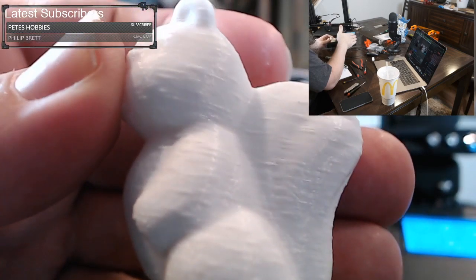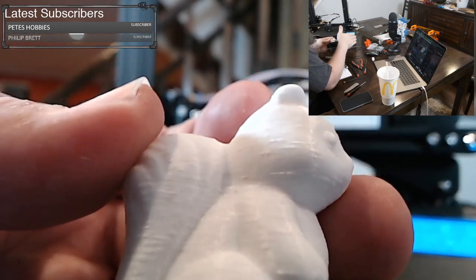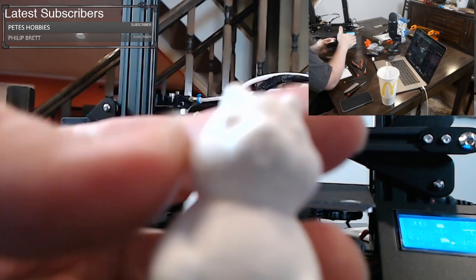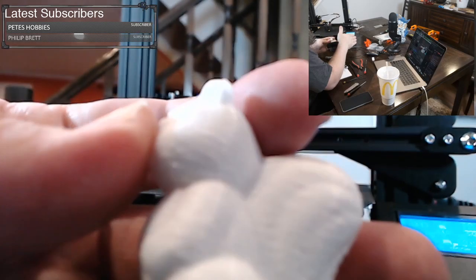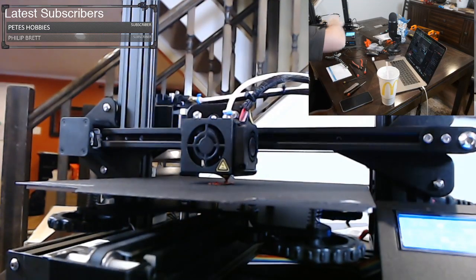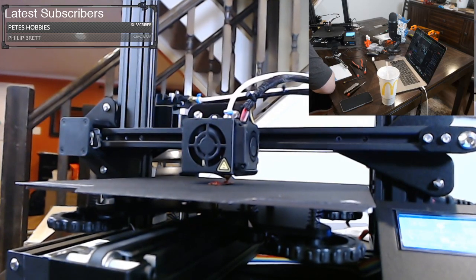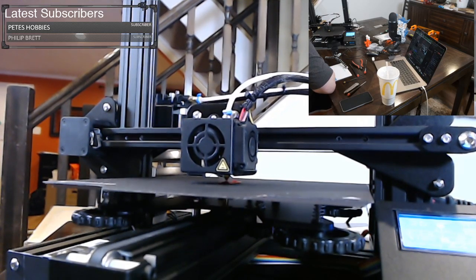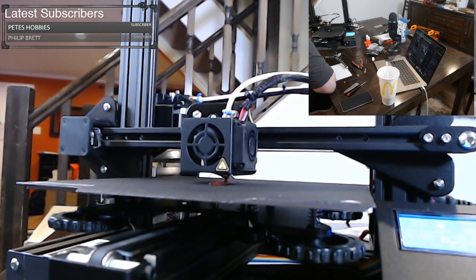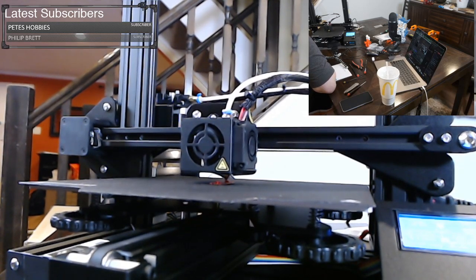That's because it's at 300% speed, and I think those ridges are actually the extruder where it's doing layer changes, and I think it's probably just shooting too much plastic, and that might be able to be adjusted out. So you might be able to get this thing to run at 300% speed and still get a good print by changing how it starts and stops layers. I'll need to do more testing to figure that out.